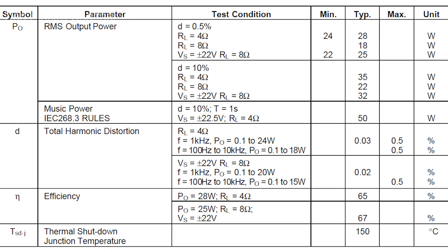Now let's look at the characteristics in the datasheet and find out the power that the TDA 2050 can produce. I will use a 4 ohm load. With such speakers, you can squeeze out 35 watts, though at that power there will be 10% signal distortion, which is not very good. But at 28 watts the distortion is only 0.5%, and at lower power the non-linear distortion coefficient will be completely minimal.